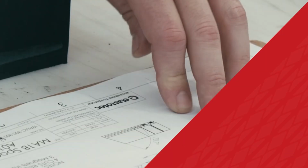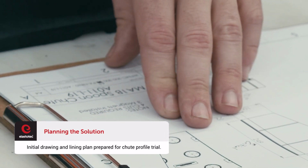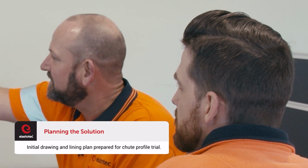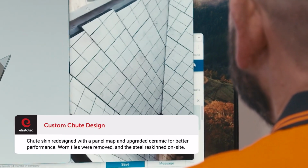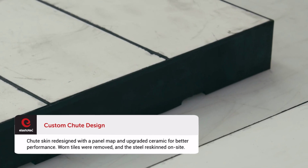We first put together a drawing which was provided by site and a plan to line the chute profile for trial. So the chute skin was designed with a panel map layout, and then a ceramic composition was chosen for improved performance.